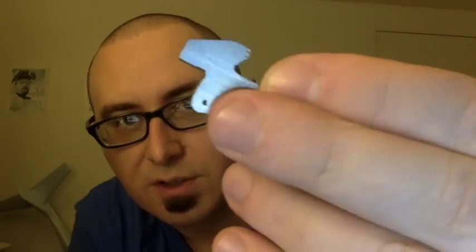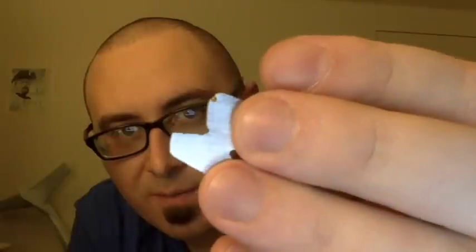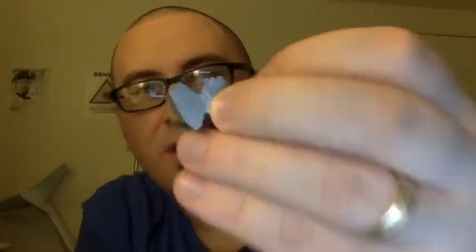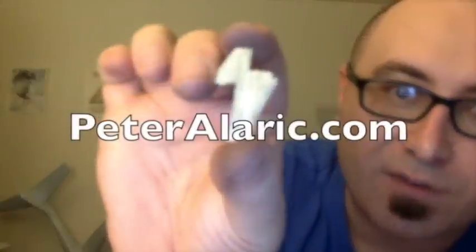Now notice there was a slight issue: there's a hole on one side, which is correct, but on the other side the hole doesn't exist and the top is sort of falling through. That's a casting issue — it was not present in the 3D printed part. I don't know if this part will be usable, but I'm going to try to repair it. Oftentimes with casting you'll have little casting issues. Sometimes it'll come out perfect, but you just have to do your best and try again. So, lost polymer casting — it's pretty awesome. I would check it out if I were you.